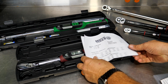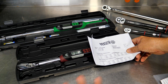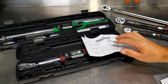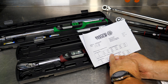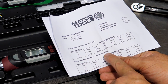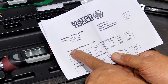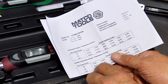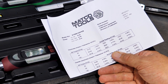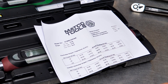If you're torquing left-handed or reverse-threaded bolts or nuts, notice that the tolerance differs by direction. Clockwise torque is rated at plus or minus 2%, while counterclockwise torque is rated at plus or minus 3%. So it's not quite as accurate in the counterclockwise direction as it is clockwise.